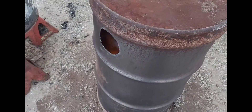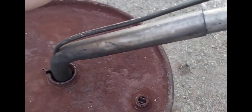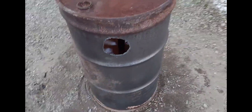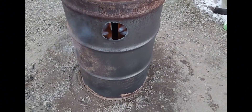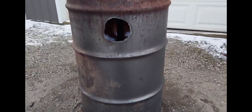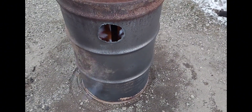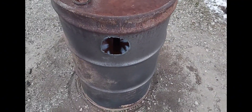That hole will get bigger - that will be a six-inch hole - but there's nothing really coming out of there, I don't feel any pressure. I'm still being fed with the two-and-a-half gallon shop vac and she runs pretty clean. Does get a puff of blue out of that hole, and I think again that's because that row of holes at the top is about even with the bottom of that hole, so it's igniting on the way out. I'll put a baffle in there to cure that problem, or maybe move that set of holes down a little bit. But you can see the nice blue flame in there - I'm pretty happy with it.